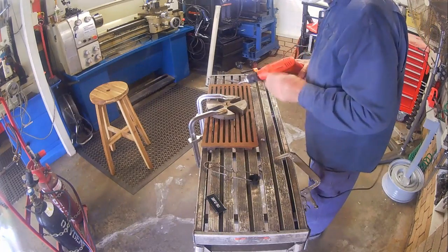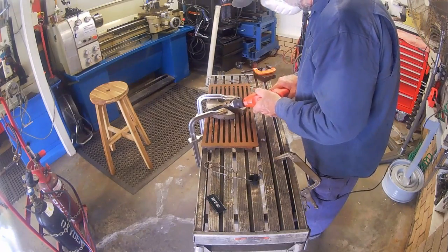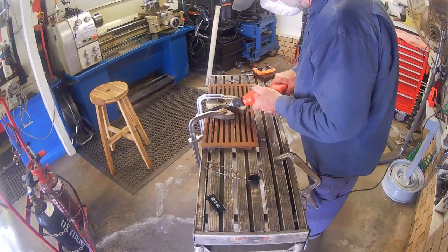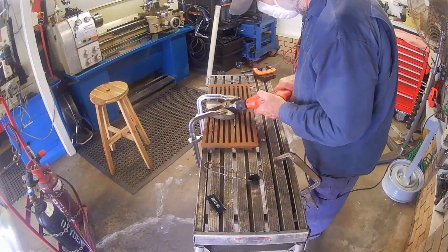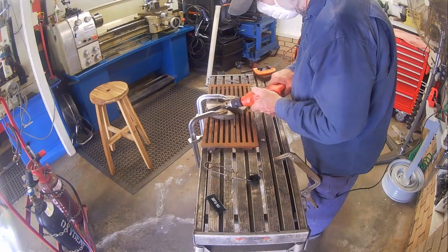This is my first attempt at the repair. Having aligned and clamped the die plate, I used a burr in a drill to groove out both sides of the crack in preparation for the repair.